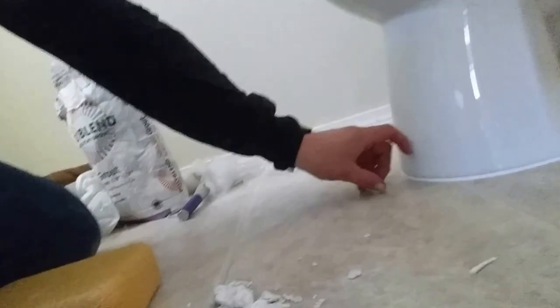On this toilet I had to use four shims. I shimmed up the back, tightened the toilet down, and the toilet doesn't rock anymore — it's smooth. I just can't believe anybody would leave a gap that huge. I wanted to share this quick video in case you've got a rocking toilet. Shim it in the back, even the sides if you need to, and re-dap it.